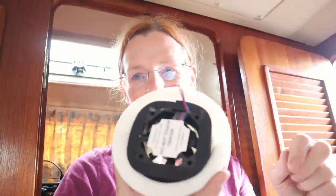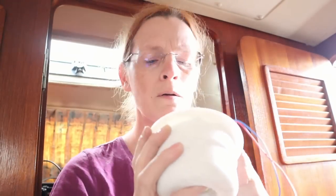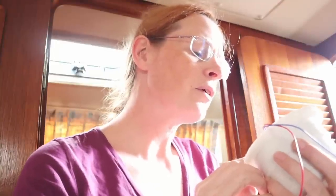They have this big sticker over it. Do not touch center. I mean, of course not, but it's just a standard fan inside. There you go. Sanyo Denki, 12 volt, 0.06 amp. So that's gonna be very, very low current draw. So I'm not too worried about junctions and whatnot. I need to figure out where I can pick up 12 volts. Let's sort that out next.